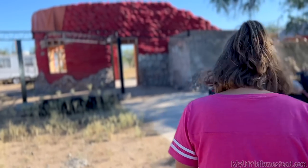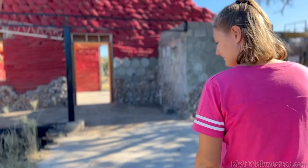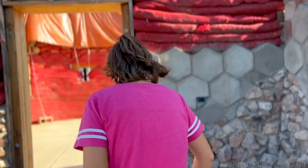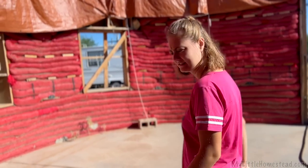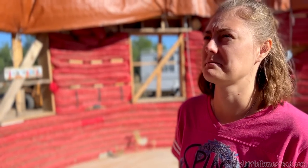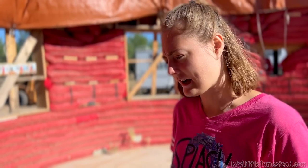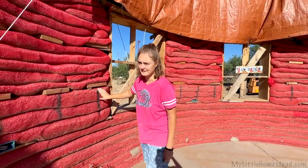These walls are a little different because they're Hyperadobe. Superadobe was closed bags for the most part. They were breathable, but these are kind of like an onion bag. We don't want any dirt to fall over the years, so we just figured sealing them in with something is probably a good idea. Might be over the top, but we're okay with that. We're going to hopper in the mud to seal in the inside here.